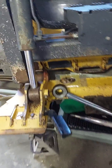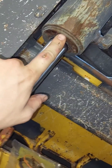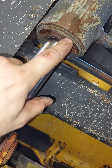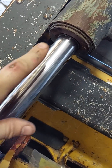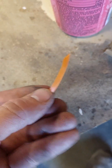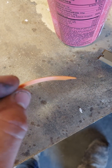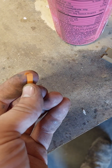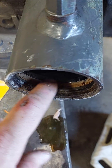There's not a lot of videos on the internet on these John Deere 317G cylinders with the gland that's got the snap ring around it and the fact that you have to have the special tool in order to get it out. This is a part of it here - it's a thin little tool, wide on one edge and flat on the other, and it's meant to sit in this groove. It comes as part of the seal kit.